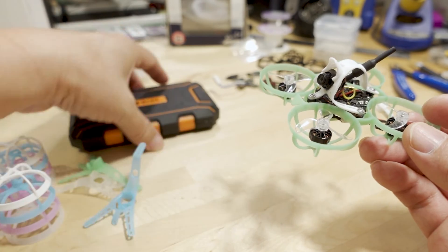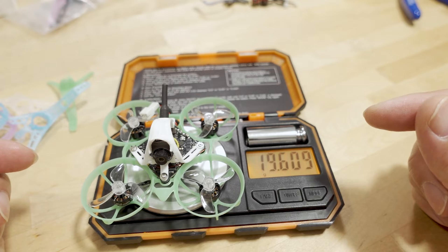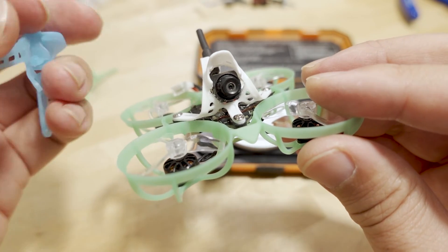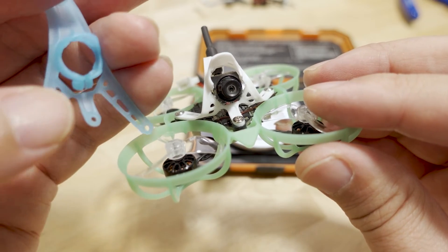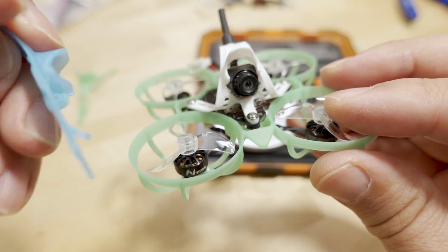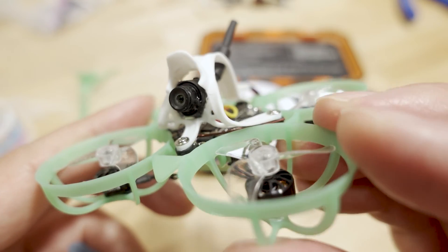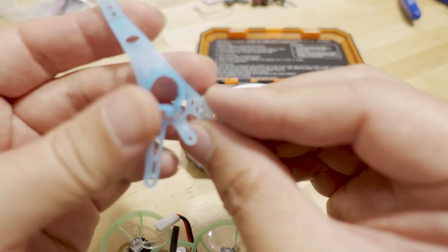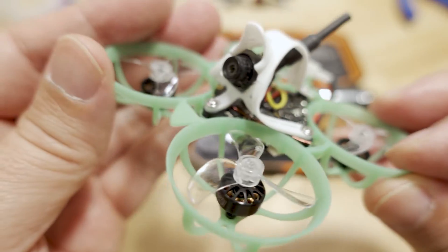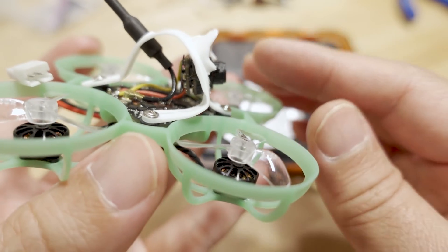I want to show you how much everything weighs. It's 19.6 now, down from 21.8 before. Something worth noting is that this canopy is specifically made for the C03 camera from BetaFPV and uses a screw to hold the lens. The Atom camera that was on the Kuhn does not fit this canopy cage, so I had to cut off some parts and use welder's glue to hold the camera in place. I've had no problems since — it doesn't move around at all and it's all lined up exactly the way I wanted.